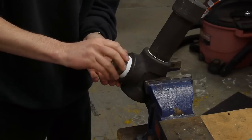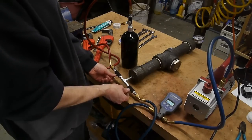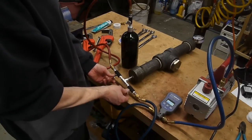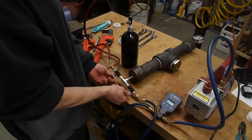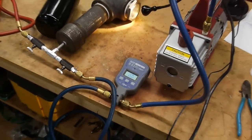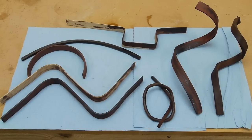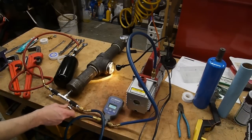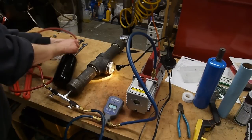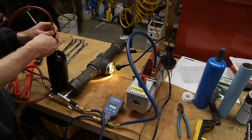I could see if anything interesting was going on during the process inside, then sealed everything up. The next step is to remove the air, because air will get between the ammonia and the wood and not allow it to react as well. I used a vacuum pump to pull out as much air as possible. With a micron gauge, getting it lower than about 1500 microns is really difficult because water naturally in the wood will start to evaporate and keep the pressure above 1500 microns. I disconnected the vacuum pump, closed that valve, then opened the valve connected to my tank of anhydrous ammonia. We just want to flow the gas into the chamber — keeping the bottle upright and opening the valve draws the gas out, and you can see it flowing in here.